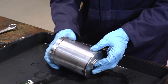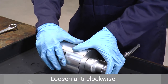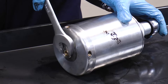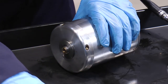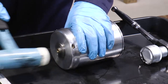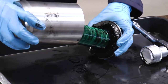First thing to do is to lie the bowl assembly down and get your spanners. Now the MP90 has a right-hand thread so untighten to remove using a spanner and untighten the cover nut. Remove the cover nut. If the washer doesn't come we can just take our mallet, hold on to the top of the bowl wall gently and tap the bearing tube until the distributor plate and bowl discs come apart.